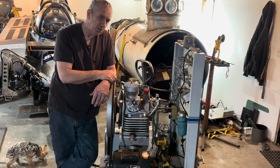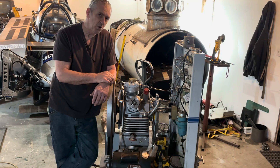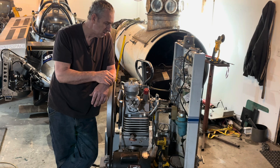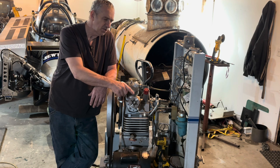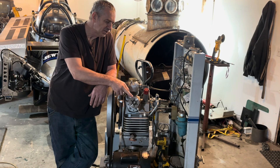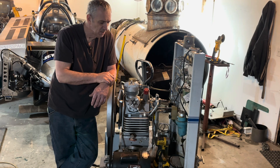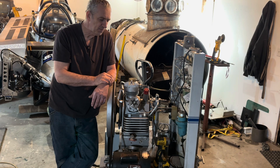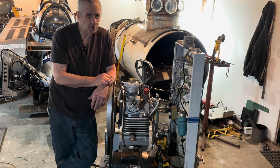I've got the first stage piston pumping now, and I've got the second stage piston valves on the workbench cleaning them up. There are little flat discs in there that are corroded, so I'm sanding them with 600 grit on glass. For the third stage, I have to take the valves apart — they're just a little disc with a spring that opens and closes. This one here is leaking quite badly; I can actually suck air through it, so I just have to take the time to take it all apart.